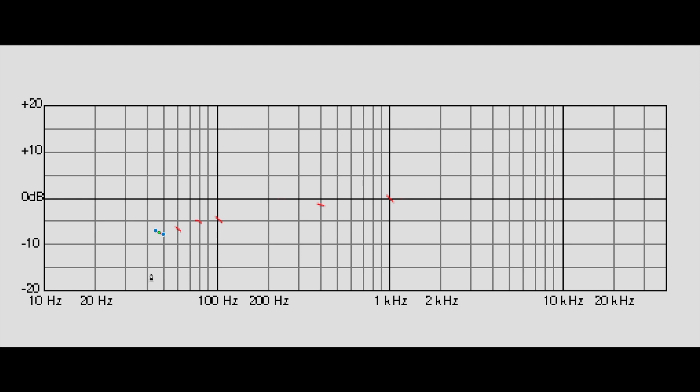At 45Hz we had minus 7.5dB, and at 23Hz we had around minus 10dB. Plus 0.3dB at 3 and 4kHz, and plus 0.4dB at 5kHz and 7kHz. At 10kHz we are back to 0dB. At 20kHz we are at minus 1dB and then the curve continues to drop. The template I found only shows up to 30kHz, but it doesn't really matter for what we are doing here.